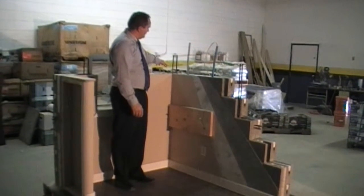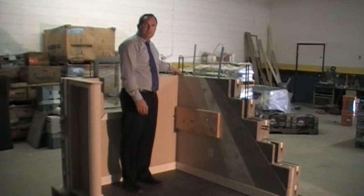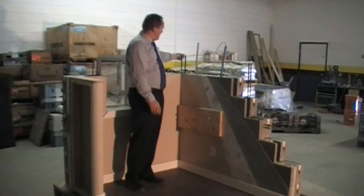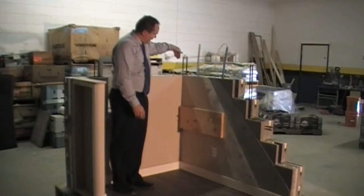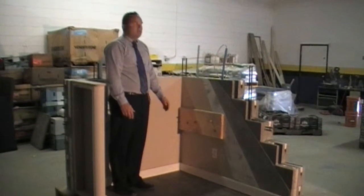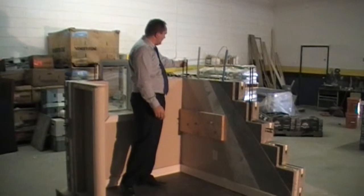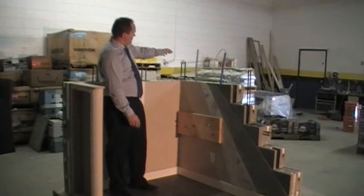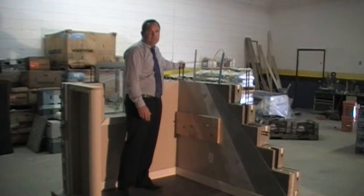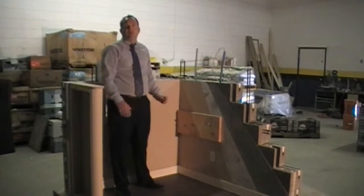The last big component is that the corner walls are a little bit different. The corner pieces have concrete right down in the corner all the way to the basement, with two rebar or one number five — a 15 mm — coming up throughout that corner section. That really locks in the corner, and then you build off of that to straighten the house out and move forward.